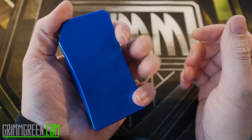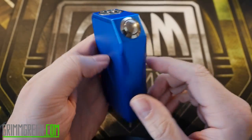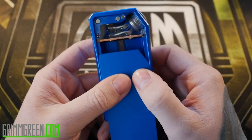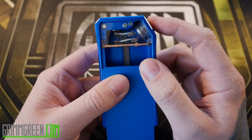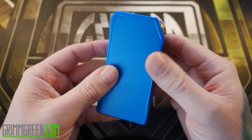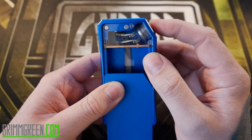It's a little bit contoured here on the sides just to make it more comfortable in your hand. You can see it flares out just a little bit at the bottom. When you set it down it's nice and sturdy. There's a spring-loaded copper 510 connection. The one thing I'm not a huge fan of is this little switch right here. I don't believe it's a full mechanical switch, and there's no MOSFET in here. A MOSFET protects your switch against the amp load of the batteries, and on a dual parallel box you're going to be running pretty low ohms — I generally run right around 0.11 or 0.10 — so there's nothing in there to protect your switch.